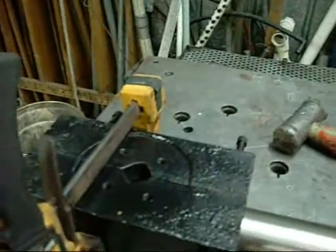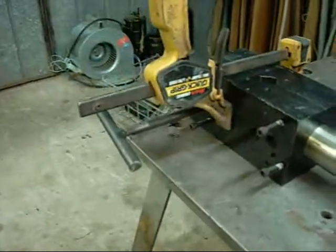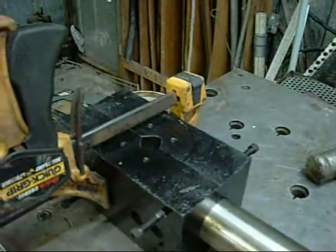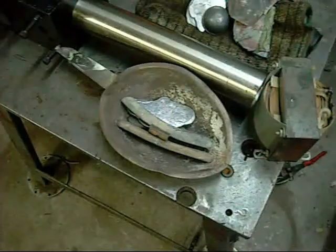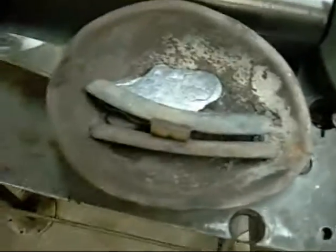It's actually quite hot at the moment so this first shot is going to have a bit of flash on it — it's worth a try anyway. Core pin is inserted firmly. I'm going to get the melt underway. The die is plenty hot so it will still be very hot by the time I'm done melting, and we'll give it a shot. I'm just using scrap lead for this — old wheel weights and other things, nothing special.